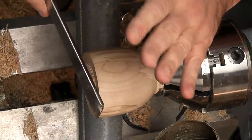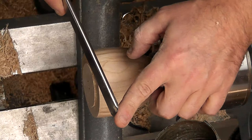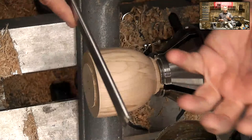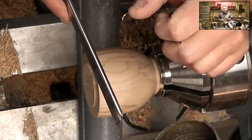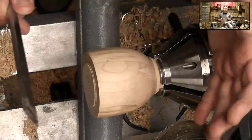What I would say, the more you bring the angle this way, the friendlier they become, but you don't get as clean a cut. The more knife-like you present or grind it, you get a much better cut, but it becomes quite aggressive. So 25 degrees for me, single side, is a good halfway house. If you go more toward 15, then you're going to start getting a bit of a twitchy chisel, and more toward 30, 35, then it's effectively blunter, but it's friendlier as well. So play with those angles. But about 25 is, like I say, a halfway house. It seems to work nicely.